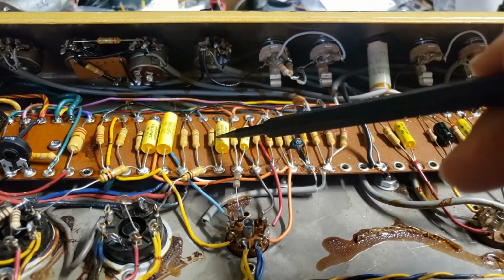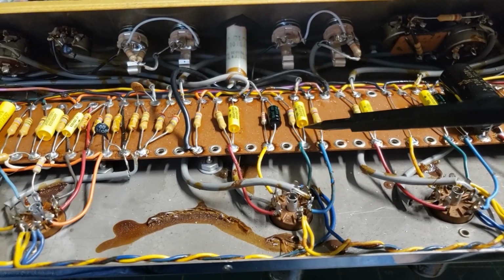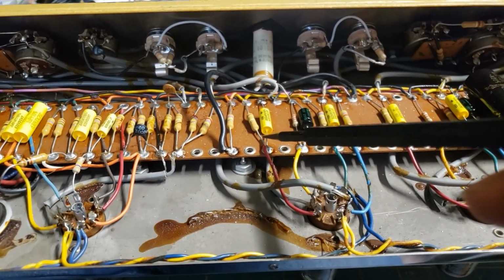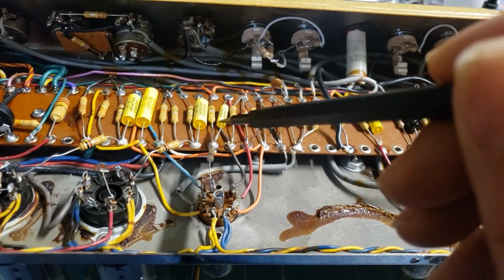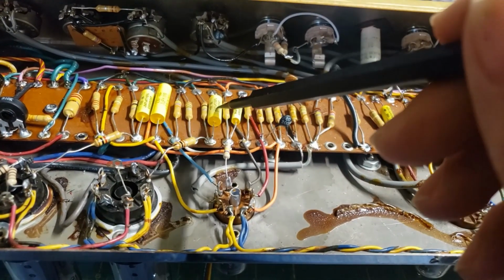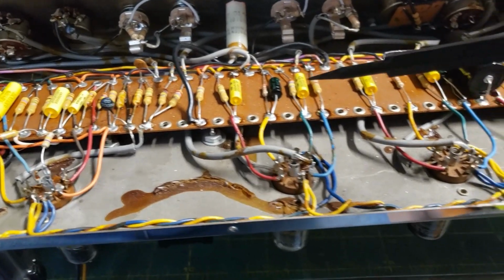All right, going through, this amp had a lot of coupling caps that were too large in terms of value compared to the schematic, and I did some math, and the schematic was correct. So where the schematic had 22 nanofarads, this particular amp actually had 100 nanofarads, and the whole thing was very woofy. So I've replaced all those hundreds and put in the proper 22s. Here in the cathodyne phase inverter, I've decreased one cap quite a bit and added a little bit of grid resistance to lessen grid clamping. On the outputs, I went from 100 to 47 just to get a little bit tighter response. As you can hear in the video, the amp's got tons of lows. It just doesn't have the flub now.